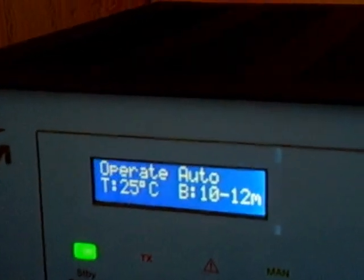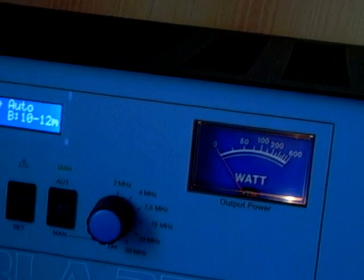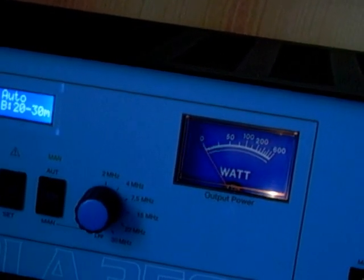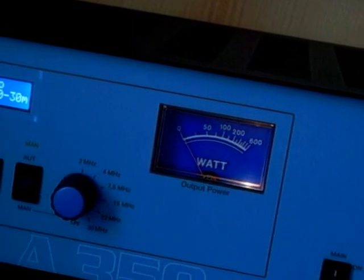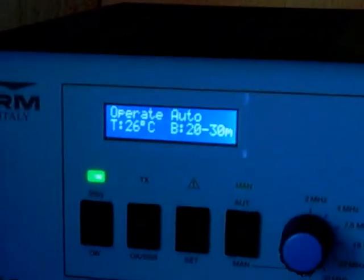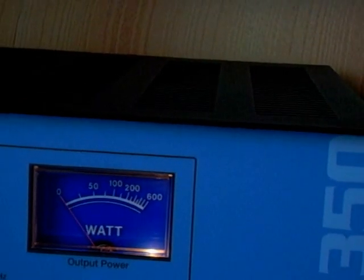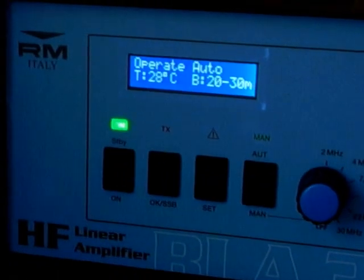Press escape, then press SET to come out of the menu and you're back to normal standby. Turn it on and now it's in operation on automatic. You get the fan first because it blows out anything in the fan. Don't forget you're on 10 watts. Now on 20 meters it says 200 watts at 14.1 MHz, and with that 9 watts in I've got 200 watts out — that's how easy it is. Put everything into automatic, it's a lot easier.